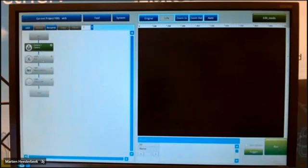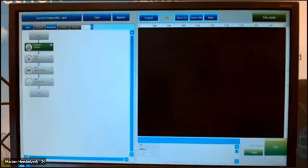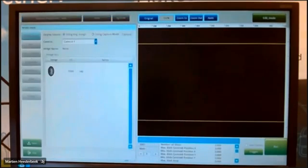It will always be after the block in green in your flowchart. You see here the orange light. That means it is not set up right or not set up at all, so I have to set it up in this case. A blob function, blob means you check on a cluttered amount of black or white pixels, and you only count more or less the size of it. The blob function gives you also the coordinates of the blob itself. That means for this cap, for example, it's black. It's quite easy. I have a lot of black pixels in that case, and I automatically have the coordinates of the middle of this blob.